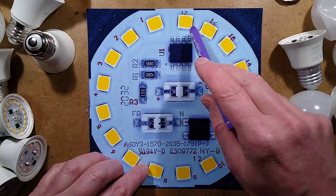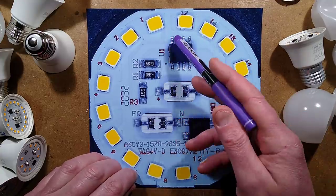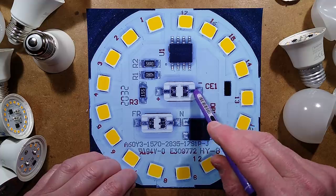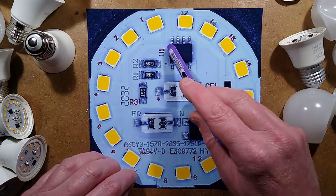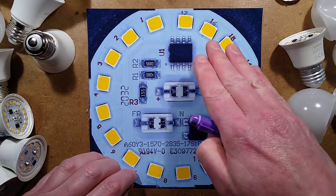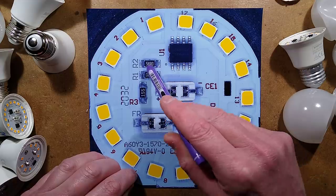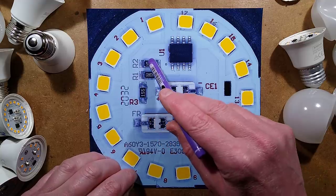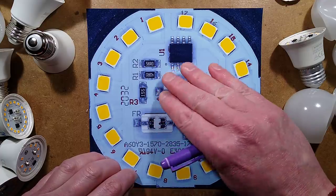The current regulation involves all the LEDs in series - not just one chip each, but several chips making up a voltage of over 200 volts for UK mains. The voltage across the capacitor rises to 330 volts, so the combined LED voltage is likely somewhere in the 300 volt region. A small component drops the difference, dynamically adjusting almost like a variable resistor. It senses current using two parallel resistors - they could use one, but two in parallel lets them fine-tune the value, and connecting two different values in parallel allows a very accurate adjustment.